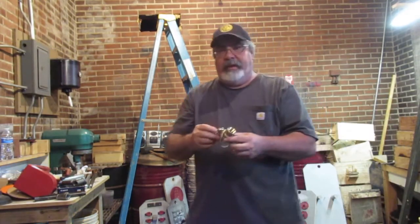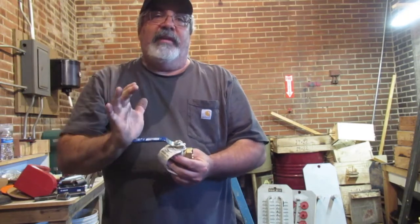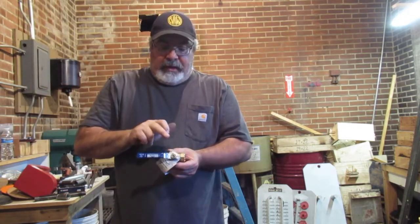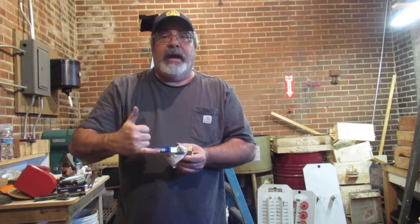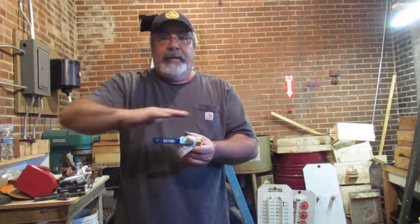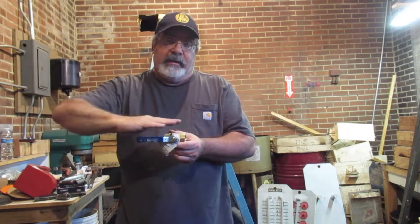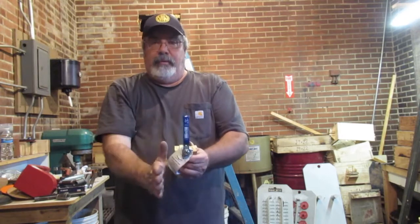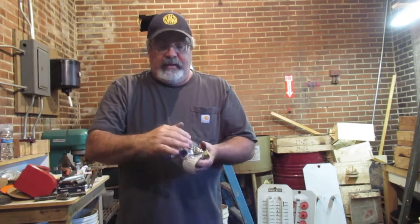Okay, here's the valves that we use. These are quarter turns, so it just takes a quarter turn of this, and you're done. It's quick instead of the old screw type. The other thing with these, which is nice, is when this handle is in line with the pipe, that means it's open. So water, hydraulic fluid, air or pneumatic, that's gonna go straight. When you lift it up like that, boom, it stops. Whatever's in that pipe is gonna stop. So these are the ones I always use.